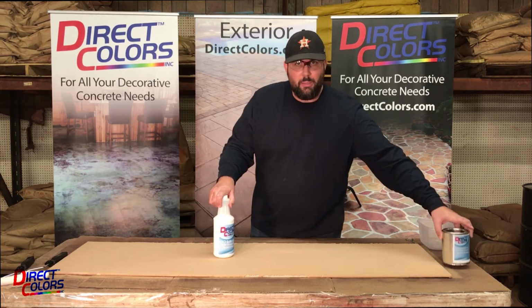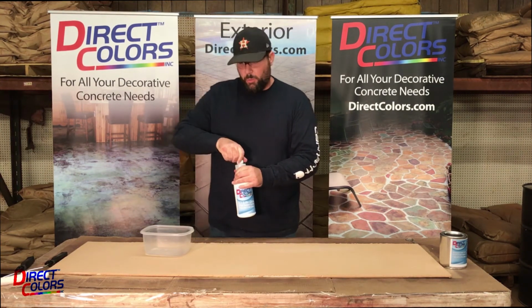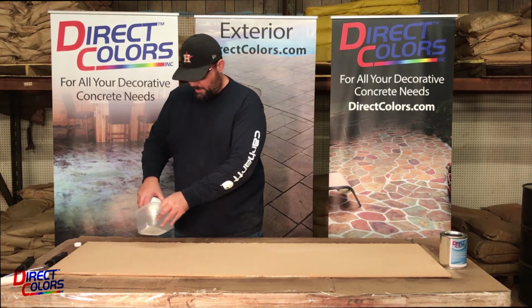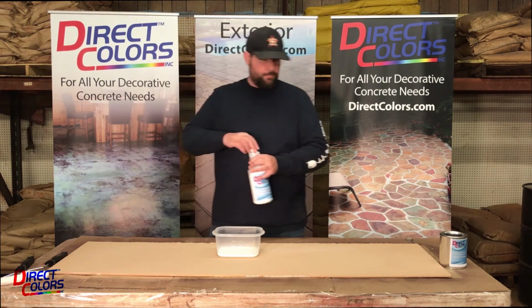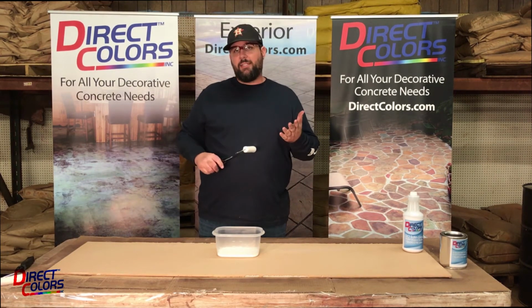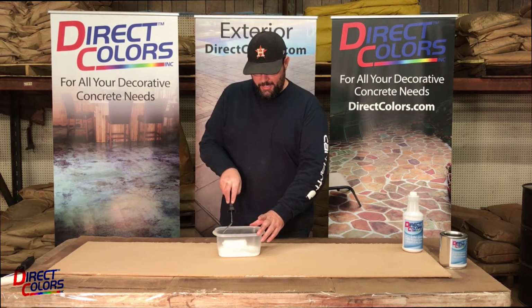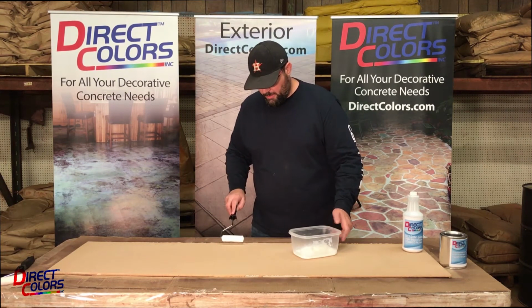So let me go ahead and start with the water base. We're just going to use a little dish right here. For your water base at home, if you're doing a floor, you would use a plastic paint tray. That would be just fine. Not going to take a whole lot of this to get half of this sealed. This has already been defuzzed. It's important to run your rollers over packing tape or something sticky to pull the loose fuzz out of it so it doesn't wind up in your finish. Okay, so I'm going to go ahead and saturate the roller, get it rolled around, and then I'll run it up the side here and get some of the excess off of it. And we'll start getting this applied to the finish.